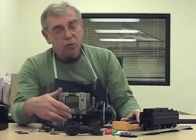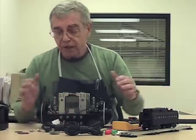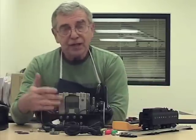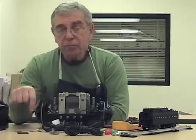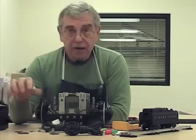After we're finished and get the unit rack assembled, we'll use a voltmeter to test the voltage at the post and also the voltage on the track under a load. We'll live test both of the throttles to make sure that the whistle works, and we'll test each output and the breaker to make sure that you've got a reliable unit that'll last a very long time.